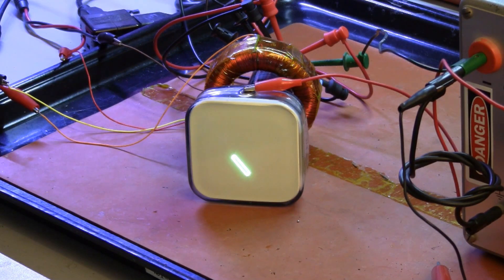Maybe later I'll build some amplifiers to drive it. But at the current time, I want to return to the NBTV dissector cam. As you can see, the cathode ray tube is operating. This is our M1234-P31 CRT, which is designed for aircraft cockpits. It has that beautiful blue-green phosphor with medium persistence, and makes an excellent testing tube for all kinds of projects. I hope you've enjoyed this part of the cathode ray tube series. Feel free to comment.